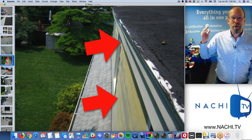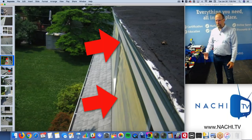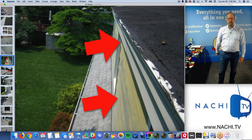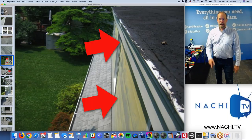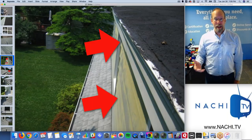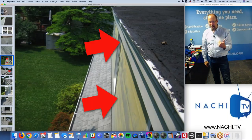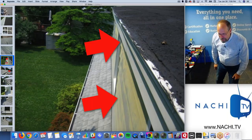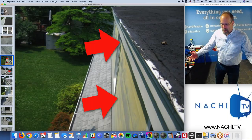Defect. There's no gutter on this house. You know how many hundreds of gallons of water fall off the edge of a roof during a heavy rainstorm in the north? This is Pennsylvania. It rains in Pennsylvania. And there's no gutter? Well, look below it. The aluminum flashing was once painted yellow. It's now gray. It's been washed off.